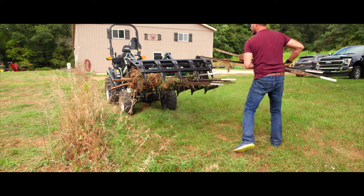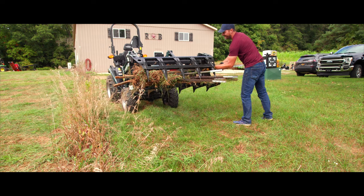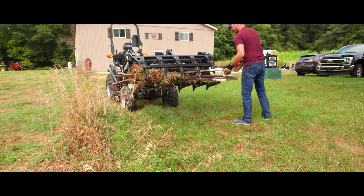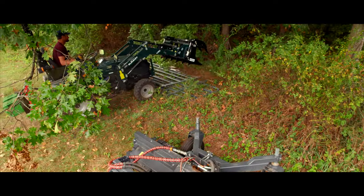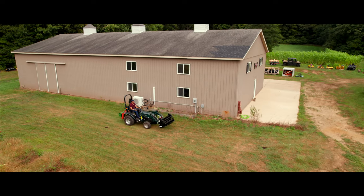All right, and we've talked about this before, but it's probably worth a quick refresher. There's a true third function, and then there's a diverter. And so a true third function is definitely going to be more expensive and typically found on machines with a larger hydraulic flow. So small compacts, subcompacts, that kind of thing, oftentimes they're going to have a diverter instead.